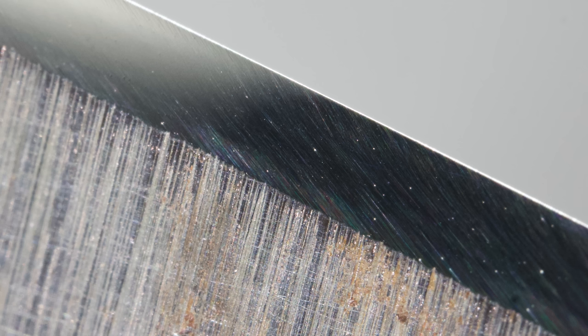Here's the first image — not as close as we can get, not even close — but I wanted to show you that you can see the mirror and you can start to see some of the scratches. These larger scratches I believe are from a contaminated strop, since I did strop this on one micron. You can't see these scratches with the naked eye, but after experimenting I found them to be present after stropping and not before. So I'm showing you this so that you make sure to store your strops in a protected environment and don't just throw them in a drawer with a bunch of rusty knives.